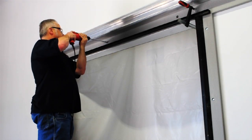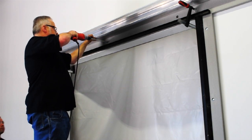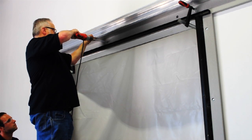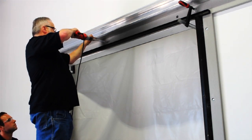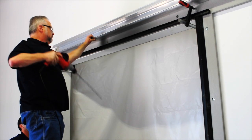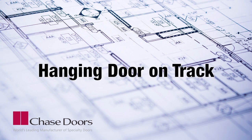There are two rows of holes in the header: one going through the track and the other just below it. Drill and install 3/8-inch fasteners in all holes. Tighten the fasteners using caution not to over-tighten and distort the header or mirror casings. Confirm the trailing edge casing is still plumb and install the remaining fasteners. Be sure to clean any debris left in the track from drilling the holes.